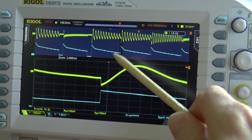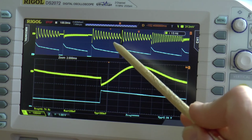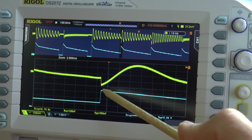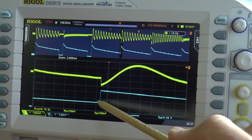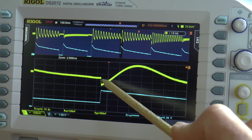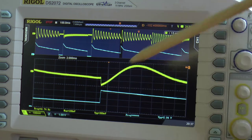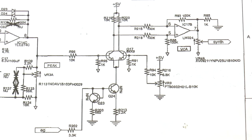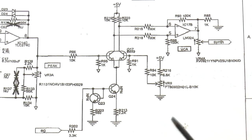You'll notice that even at these points where the voltage doesn't get all the way to zero or coming up from zero, you can still have problems with instantaneous rises or falls of voltage chopping the waveform basically and creating a place right there that would cause a click or a pop. So I tried a number of different things to try to eliminate the clicks and pops.